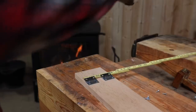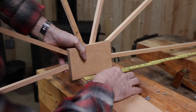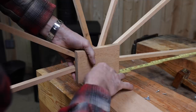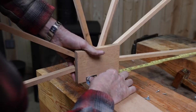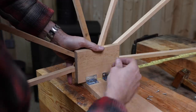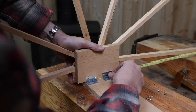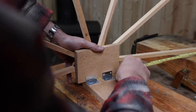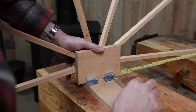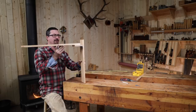Your arm should look something like this. Now we're going to mount the hinges to the top. When you're doing your hinges, the hinge part sticks out a little bit further than the top plate, so always hold them up a little to get proper alignment. These will sit flat. They're one inch in from each side. When you put these little screws in, it's really important — the heads have a taper on them. If you don't start the screw in the center of the hole, when you tighten it, it will pull the hinge out of alignment. Take special care to get them started right in the center.